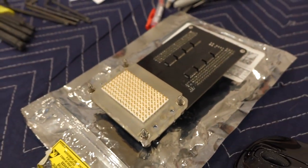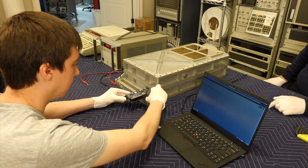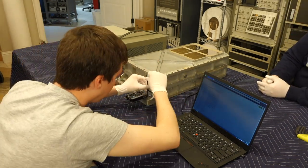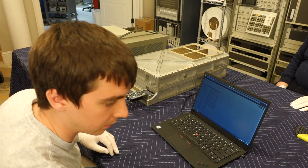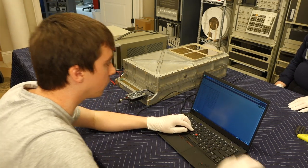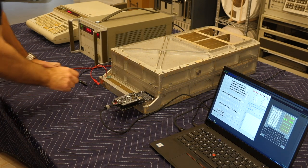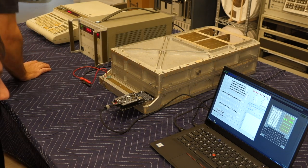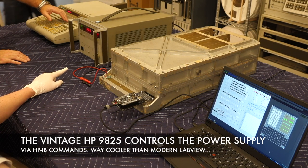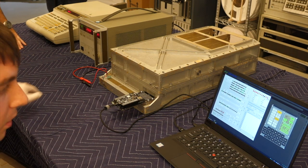Using the Samtec pins you can connect it — we have the remanufactured original pins. So go for power up. Watching current, it should be about 1.3 to 1.4 amps. Three, two, one, zero. Okay, that looks good. Oh, it runs! It runs! Oh, we got a DSKY display — look at that! Look at all those blinking lights. We're getting only one hardware alarm, and it's the PIPA alarm, because the PIPAs aren't giving us the plus 3 minus 3 acceleration signals.